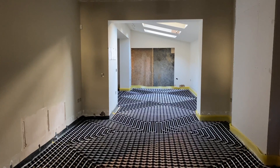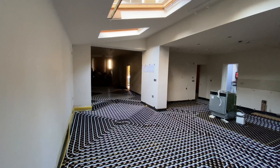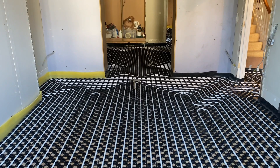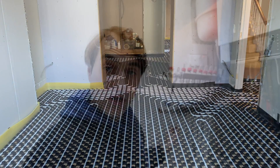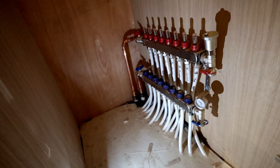Part of the work of getting the property ready for the heat pump was fully insulating the ground floor with 100mm rigid insulation. We installed new underfloor heating on 100mm centres on castellated panels and screeded the floor with 30mm thick gypsum screed, just to give it the highest possible output. This manifold we installed is pressurised now — it's just hanging in the air because it will go either here or where the cylinder is. There's another manifold in the middle of the property, because the ground floor area is around 150 square metres.